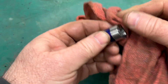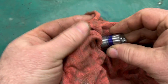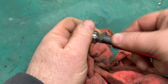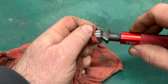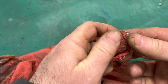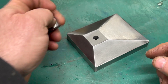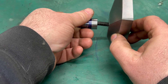The lathe operations are complete. There's a little pip on the end of it, but I'll use my hand deburring tool to get that off. I want to go ahead and mount this to the base and see how it looks - I've got an inch and a half long 5/16-18 socket head cap screw. We'll get this tightened down and see what it looks like.